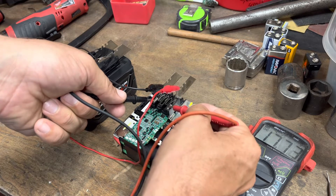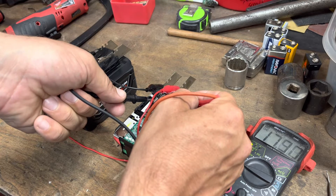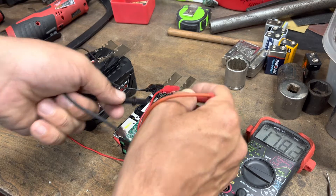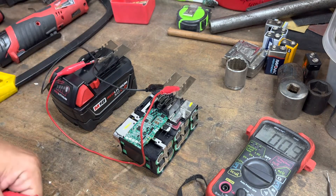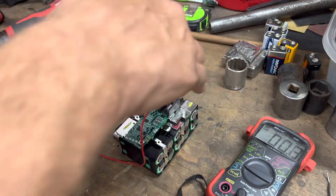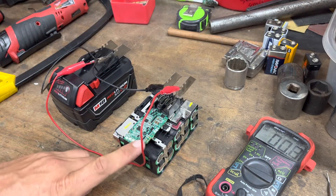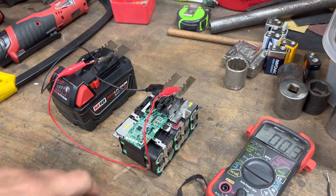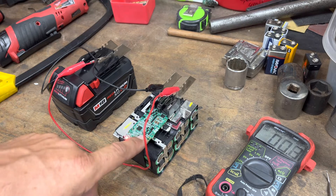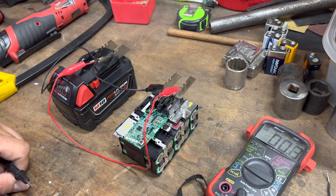Pack is at 17.85V... 18.9V... 19.0V. All you do is let that voltage steadily increase, then eventually plug this onto your charger. The charger will see enough voltage and say 'okay.' I'm hoping on this one the battery status indicator light will stop having a bad mood and start indicating a decent battery.